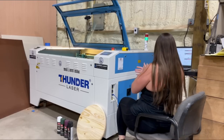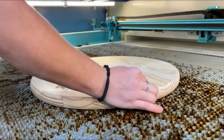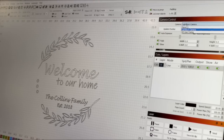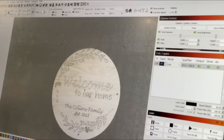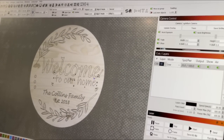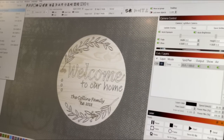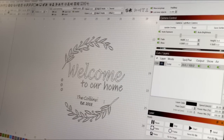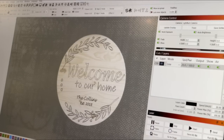I'm now going to place the background that I'm using for the sign inside the laser bed. Once that's complete, I went back over to Lightburn and made sure our camera was connected. By hitting Update Overlay, it displays the design on top of my board. I'm moving the text and artwork around until it looks best. After saving, I opened the first design I made off-camera and decided to stick with it. I removed the word Family and centered the text, then clicked Update Overlay for the new picture.